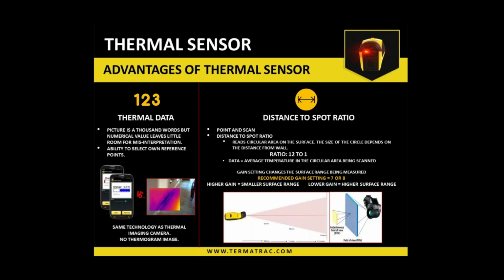So I mean, also, you know, if there's a timber window frame, for example, you wouldn't run the Termatrac over the block wall adjacent to that to start with. You'd go to the timber and you could run your radar across that, because if they're coming up through the block wall and they're not visible anywhere, they could be within the timber framing of that window. So it would make sense that you go to that timber and you go, okay, well, I'm not getting any activity in this timber here. You can go around the window on the blocks, not getting any activity, but you wouldn't continue further and further unless you picked up some more evidence of them. Yes, true. Yeah. And then obviously if you do pick up anything, then you're going further, but you've been given a pathway to do that procedure by picking up something else in another area.